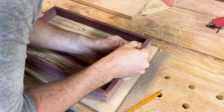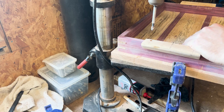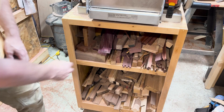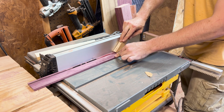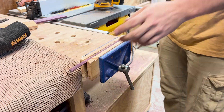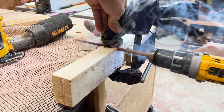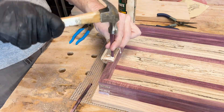I wasn't thrilled with how simple the handles turned out, so I wanted to add a little something else. Since the splines were already incorporated into the side pieces, I thought I'd go ahead and add purple heart dowels to the handles — functional and aesthetic, best of both worlds. I measured out the position of three dowels on each side, a quarter inch from the middle since the wall thickness is about a half inch. I took the board over to my drill press to make sure the holes were perfectly centered and used a quarter-inch Forstner bit, drilling out all six holes with a stop distance of about three-quarters of an inch. I then grabbed a scrap piece of purple heart, headed to the table saw to cut it slightly over a quarter inch, rounded the edges in my vise with a sander, and used a doweling jig with a chisel to make a smooth quarter-inch purple heart dowel — it got a little smoky at the end there though. I then added glue to the dowels and holes, hammered them in, cut off the excess at the top, and let it sit and dry for another day.